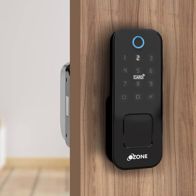Press 2 for user setting. Press 1 for add user. Press 2 for delete user. Enter serial number, which you want to delete, for example 011. Press hash to confirm. Delete user successful. Press star to go back.